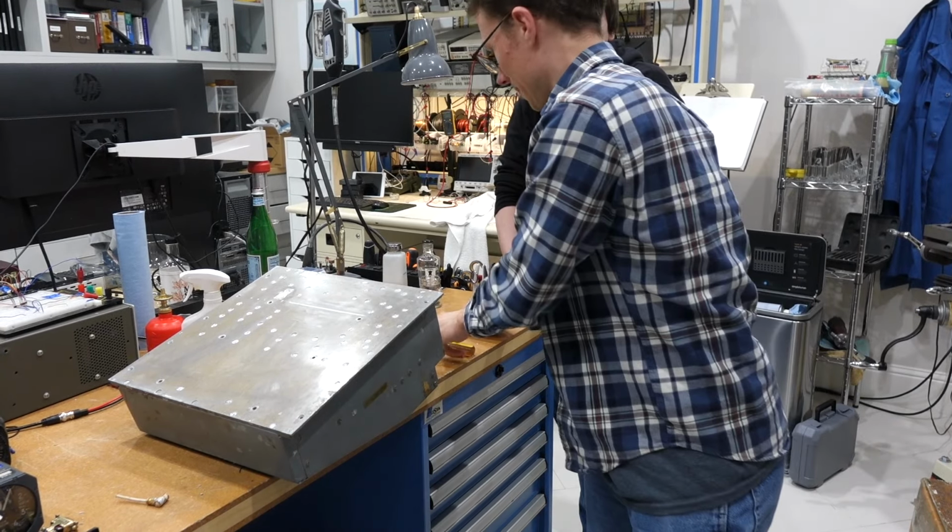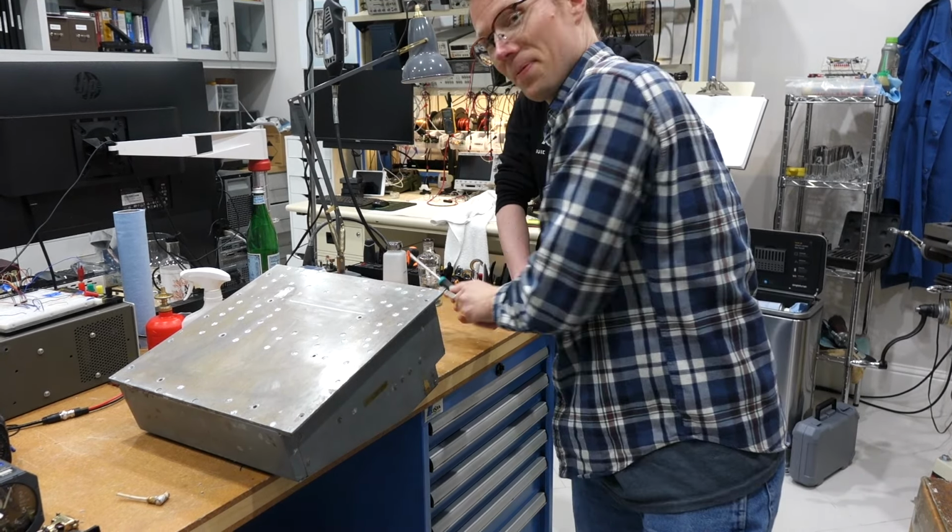Mike and Eric. Hello. What is this big chunk of metal you're working on? It's very heavy. This is a Block 1 inverter. One of 3 of these that were installed in the command module that took in 28 volts DC and put out 115 volt RMS 3-phase 400 Hertz AC power. The good avionics AC. So 1 kilowatt, 1.5 kilowatt-ish each, right? One for each fuel cell, which was 1.3 kilowatt, something like that.